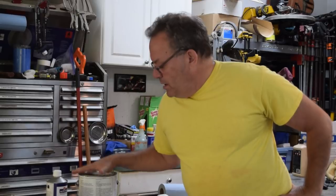Good morning. It's October 3rd, 2019. Hot autumn, as we talked about yesterday, hot autumn here in Atlanta continues. It's going to be 97 degrees today, so it's a little before 8. We're going to get started spraying sealer on the project here before the temperature gets too high. First step is to wipe it down with some naphtha, and then we will shoot it. I bought a brand new gallon of sealer and a brand new gallon of 40 sheen lacquer, so I'll make sure we don't have any problems by using older stuff that's been sitting on the shelf for a while. So let me get the table and leaves wiped off with some naphtha, and then we will get cranking on spraying the first coat of sealer. So here we go.